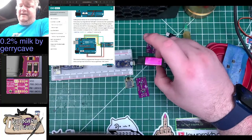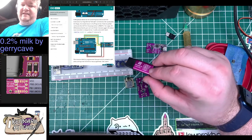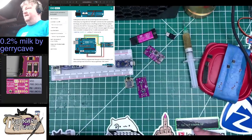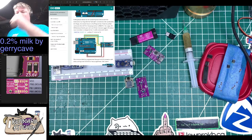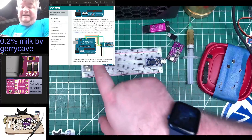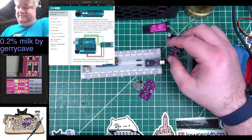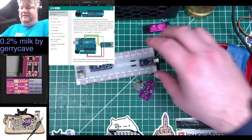I don't know. So that's why I'm like, this is just some pins connected to a microcontroller, but it does say SW clock, SWDIO. So this could be I2C instead of SPI. So I don't know. At any rate, this ST-Link doesn't work for ATtiny85. That's good enough for me to know that it's not going to work. But I can't imagine I can't use just a regular Pro Micro as a thing. Or even this, because it's basically the same thing. I just don't know what that is to be able to program it. So I'd rather use the Pro Micro, which I'm more familiar with. And it's not like I don't have 100 of these things. I'm like, oh, but I'm burning a controller that I'm never going to use for anything else. Anyways.